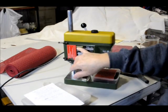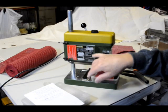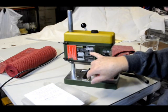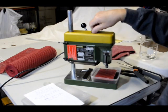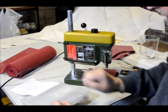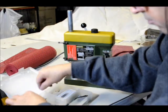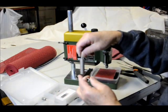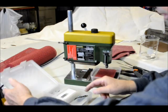On this particular drill, I'm using the Proxxon P-R-O-X-X-O-N TBM 115. It's a three-speed drill that goes from 1,800 to 8,500 RPMs. I use the middle speed — that works best for almost anything. If you use a larger drill bit than 1.5mm, you go at a slower speed, because the surface area is larger and it has to turn slower, otherwise you'll burn it up.